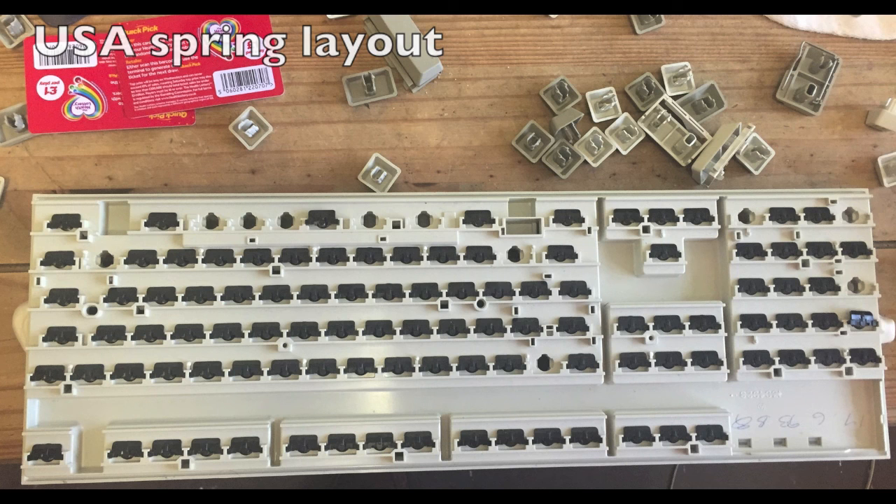If you have a fault with your M2 such as all keys not working or the three LEDs lit constantly, it's probably a fault with the keyboard controller circuit shown here. The fix is pretty easy if you have fair soldering skills — mine are pretty bad but I've repaired a few of these keyboards, so it must be easy.